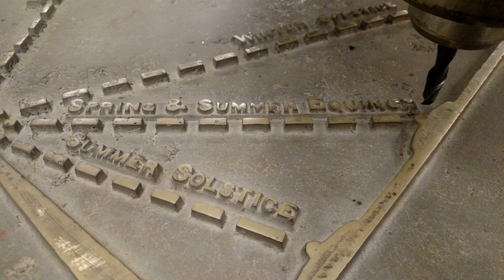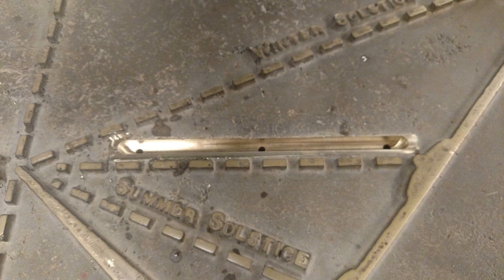This wasn't terribly critical — I mean I was machining all that lettering off, I just needed to make sure I wasn't going to run into any of the other features of the manhole cover. Once I got it as straight as I needed it I just machined off the words and then plunged down and cut a nice long slot. I'm going to machine a matching tenon on the back of the piece that has the words, and I went ahead and drilled three clearance holes for screws that I'm going to tap into the worded section.